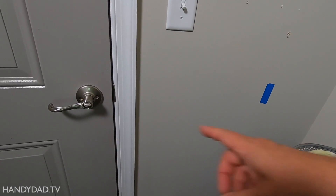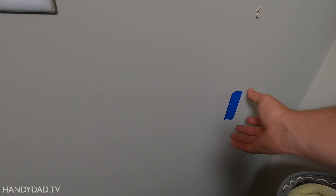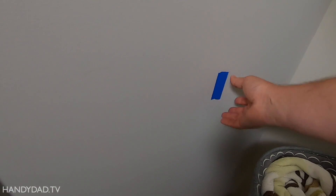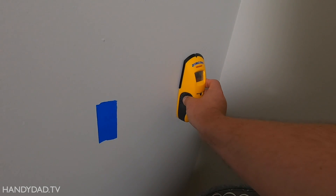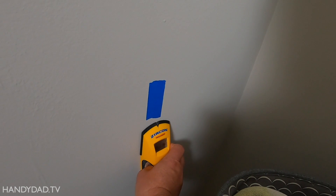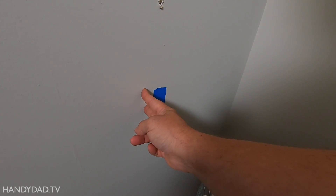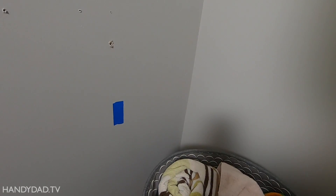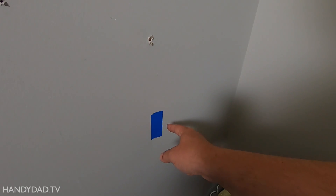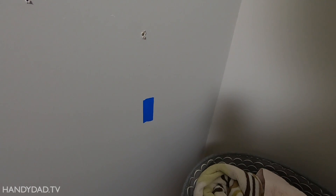I measured on the outside from the door frame over, and that outlet is right about here in the garage. So I'm just going to use my stud finder. The stud is on this side of the outlet, so this is a hollow cavity here — hollow except for the insulation. All I have to do is bring the wire out of the wall somewhere down there where it'll be hidden by the cabinets.